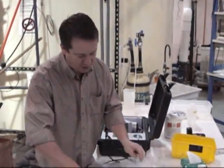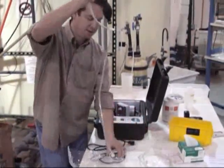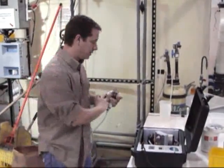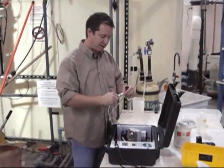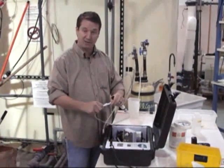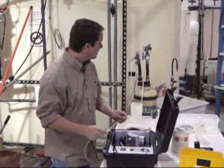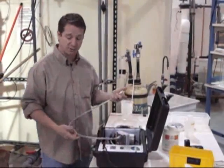You'll want to open your package. The one with the filter and the primer bulb is for the inlet of the pump — that tubing is in here. You'll want to take the male and the female quick connect and put those together and assure that they are tight. This is the outlet tubing, and you will want to put this on the top part of the electrolytic cell.